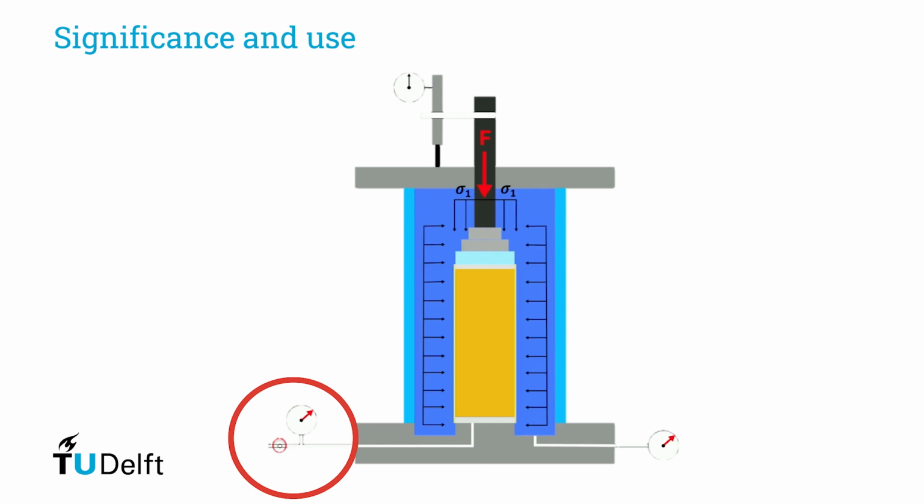In this test method, the compressive strength of a soil is determined in terms of the total stress. Therefore, the resulting strength depends on the pressure developed in the pore fluid during loading. Furthermore, fluid flow is not permitted from or into the soil specimen as the load is applied. Therefore, the resulting pore pressure and hence strength differs from that developed in the case where drainage can occur.